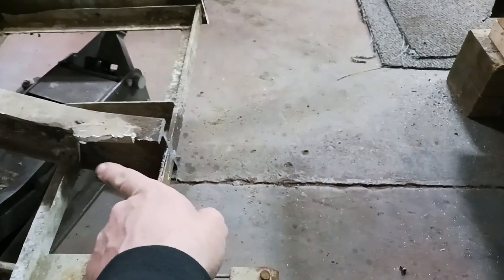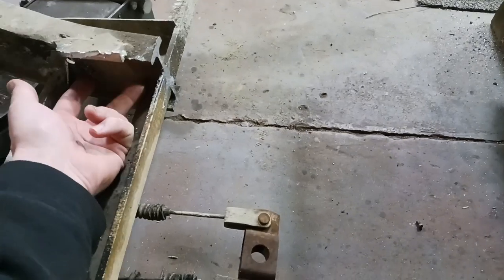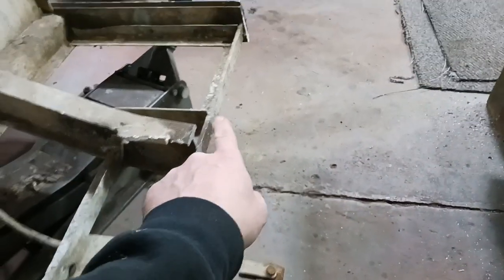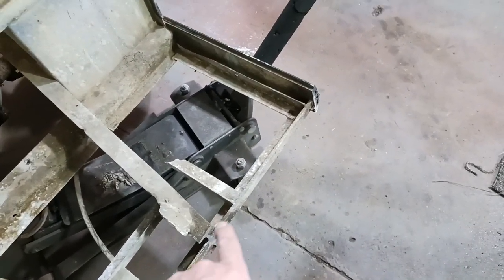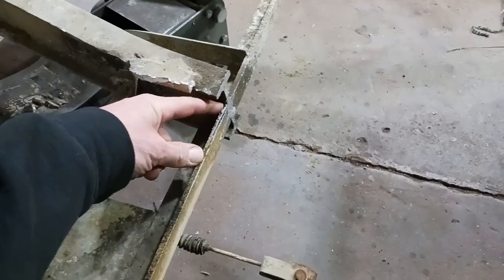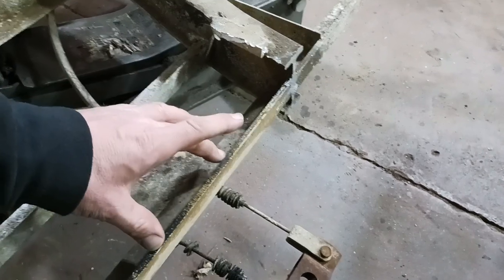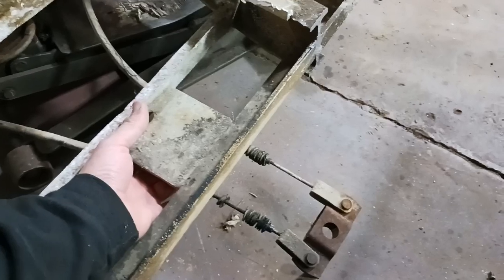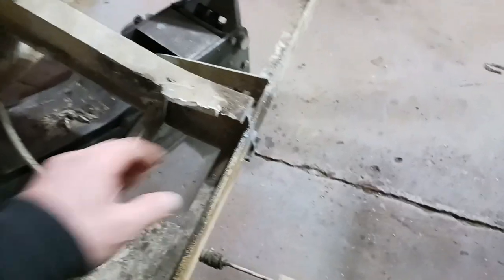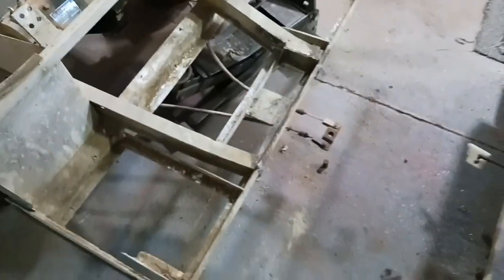Now what I think I'm going to do — I have to be able to come through here, either on the inside or the outside, because I'm going to have some pieces of steel in here that are going to bolt to this. There will be two bolts here and then the same thing on the inside — two bolts here. The problem is this one brace right here is in my way. So I think I'm going to leave this section connected all the way out to the edge, and then I'm just going to notch this out right here — maybe from here to here, just remove this much. I can brace it up better in the middle where the brake setup is on the bottom. I would rather take some out here than on the outside, because I want this all really, really sturdy on the outside.